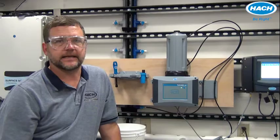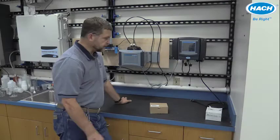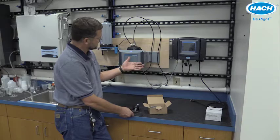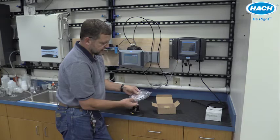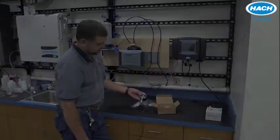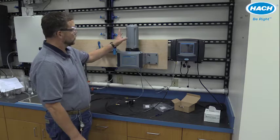The TU5's flow sensor provides immediate information on flow rate of sample through the turbidimeter. Operators can be alerted to changes in sample flow as soon as they happen, allowing for faster detection of problems within a process. Due to its importance, a flow meter is recommended to be paired with the instrument at the time of purchase, however it can be easily added to the turbidimeter after the fact. The flow meter box includes the flow meter itself, an accessory cable, a short length of quarter inch OD tubing, and the necessary hardware — two screws — to mount the flow meter to the bracket.